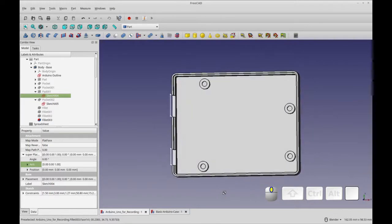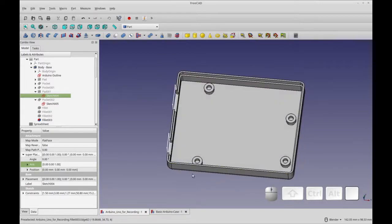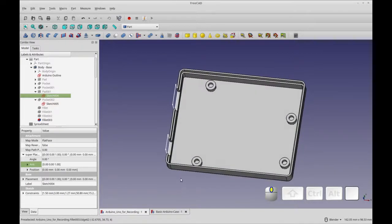The other thing I did, which you won't see reflected here, is at around 17 minutes 30 seconds in the video, I put in 3.97 for the distance from this corner to the center of this post. But as you see here, it's actually much more — it's 13.97. So I missed the 10s place there. You'll have to correct that in your drawing if you didn't already.